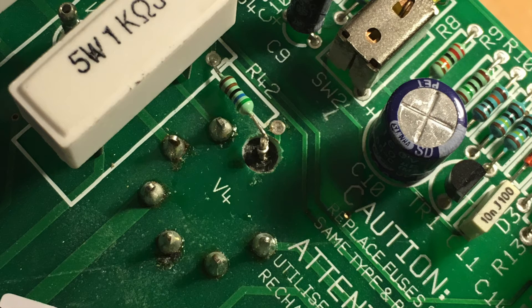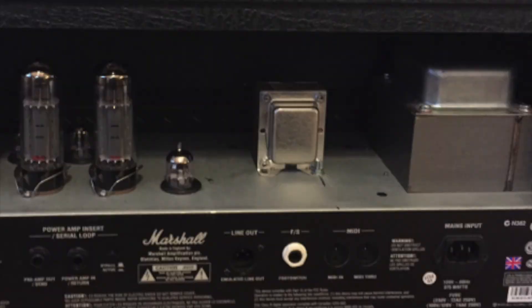After verifying the bias voltage, it's time to bias the tubes — put them in and see what you get. When I did this I was able to track down a bad tube, which was likely blown due to this bias issue and probably why I saw the amp in the first place. If you're happy with everything, put it back in, play the instrument, and test it out. In this picture you can also see the choke I added sitting right beside the transformer in the phase inverter tube.